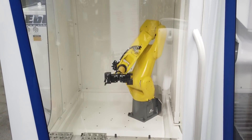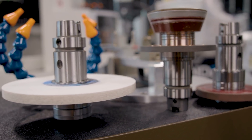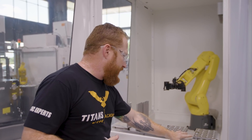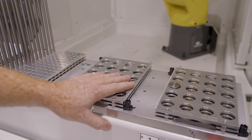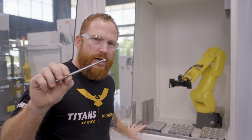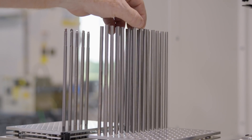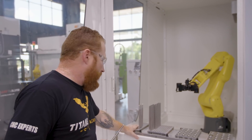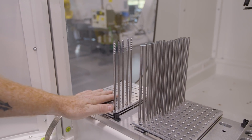I'm going to show you guys how to get that all set up, show you some of our wheels, and show you the process for how we can get this part manufactured. As we're setting up our robot, we have our three-quarter inch pallets here which we're not using for this particular job, but we have our quarter inch pallets since we're using a quarter inch surgical steel. We're going to load these all up so that the robot can put them in the machine for machining and bring them back to this pallet once the process is done.